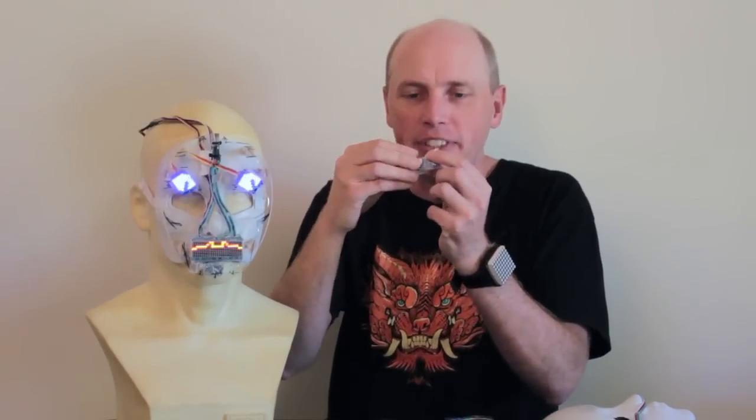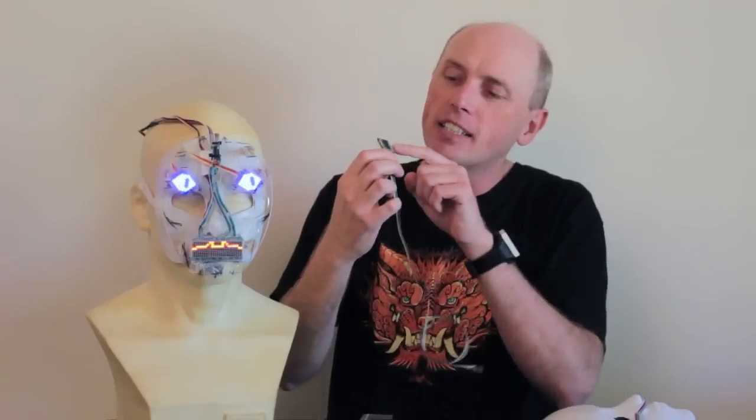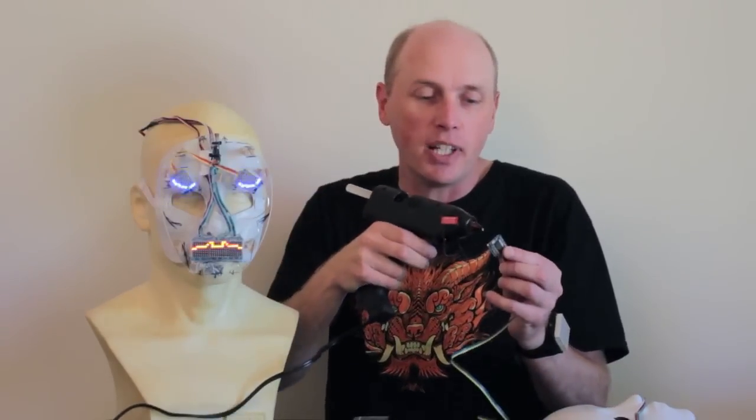There's a lot of moisture and breath, and that's going to wreak havoc with our electronics, which are right in front of the mouth. For the microphone, I sealed it inside a tiny Ziploc bag using a rubber band, and that keeps out the breath and the spit and the yuck. Likewise, the LED matrices have some tiny solder pads on the back, and bits of moisture can bridge those and cause confusion. So I used a hot glue gun and covered up those pads, and so far it's worked pretty good at keeping out the moisture.